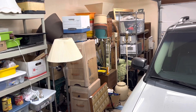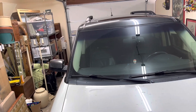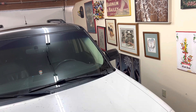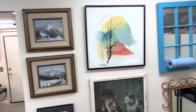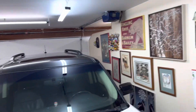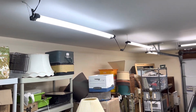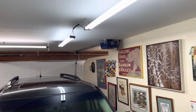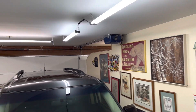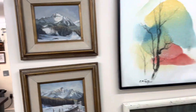She buys and sells a lot of antique collectibles. The problem was I would be working in my shop and the dust would creep over to her side. So she put some pictures on the wall, which is nice. We gave it a warm color, white ceiling to calm down all the fluorescence. The old ballast fixtures with flickering lights are gone, and we got these real cheap LEDs that just work fantastic — they don't weigh anything, you can drop them and can't break them. You can daisy chain them because they only pull 40 watts each, so you could put four or five together easily.